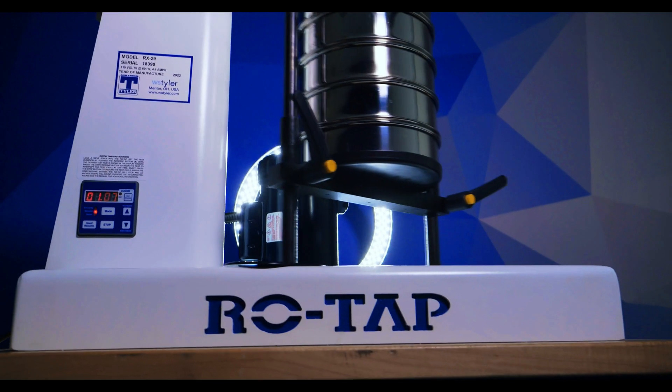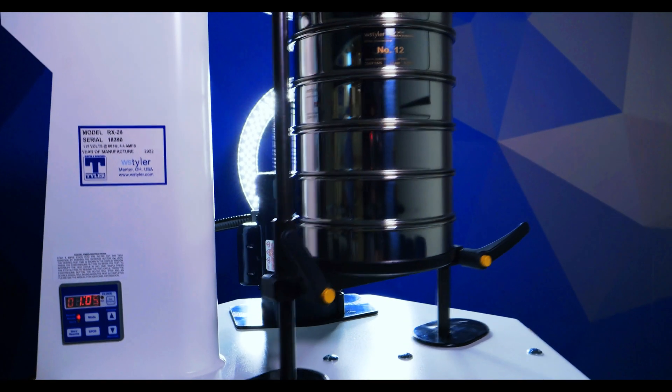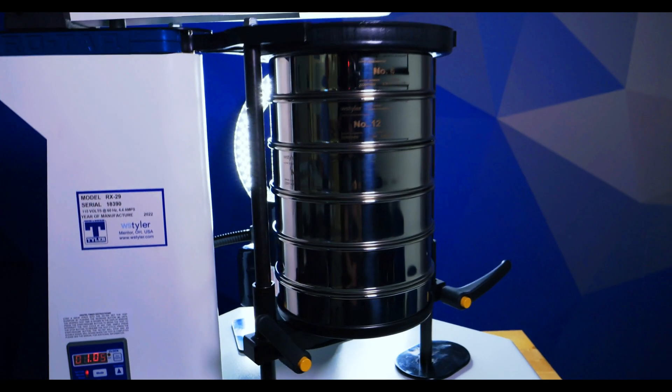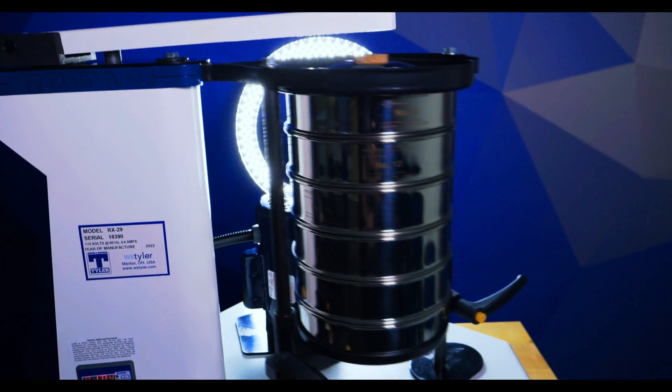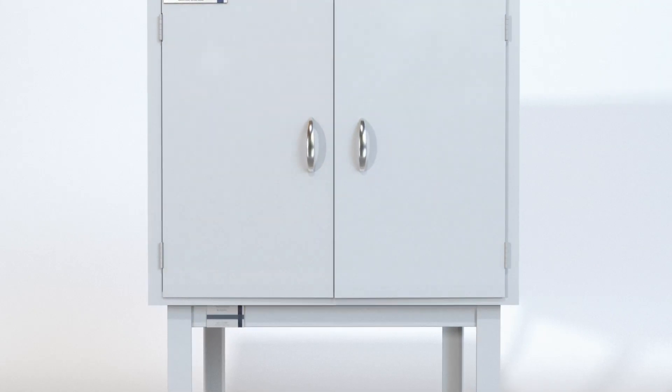The Alpine works with an industrial vacuum cleaner, so there's some noise with the operation, but it's less than the Rotap. Because of the way a sieve shaker is designed, they can be quite noisy. The Rotap sieve shaker was designed to use a hammer to assist in the agitation of particles to help them find the sieve openings, so the machine runs at around 85 decibels. To help with the noise, you can purchase a sound enclosure cabinet. The noise level can increase depending on the types of material you're testing.